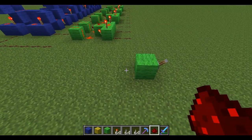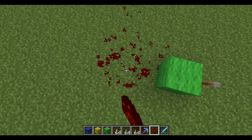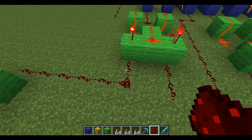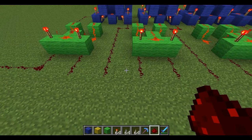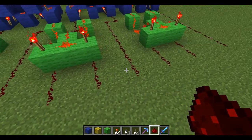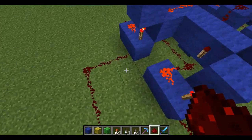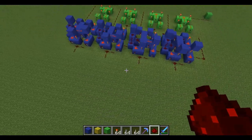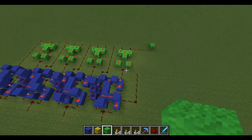This switch will lead to three places. It's going to lead to all of the first inputs of the XOR gate — so it'll lead to that one, this one, this one, and this one. It's also going to lead into the carry-in, and the third and final place it'll go to will be to the fourth output. I'll explain this when I come to it.